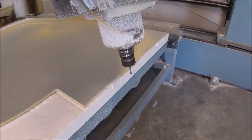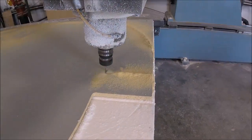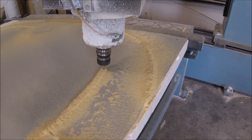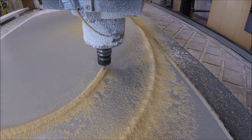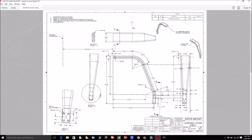We're using the quarter-inch acrylic bit and cutting in a quarter inch at a time — two passes to get through the half-inch MDF. It does a nice clean job and doesn't take too long.